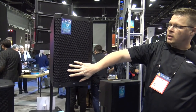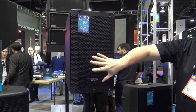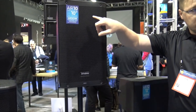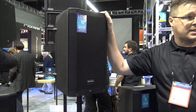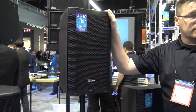This particular unit is our Air 10. It has a 10 inch driver with Class D amplification. Up in the top you've got a 1 inch compression driver with a Class AB amplifier on it. The idea behind that is that a Class AB is going to be a lot smoother in the top end, so it makes these actually very pretty sounding.